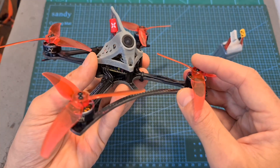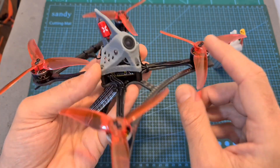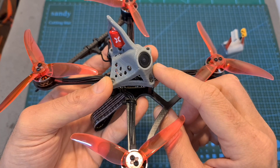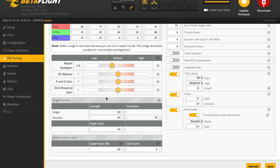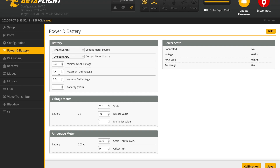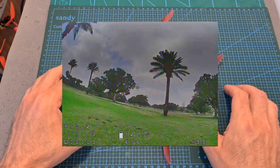You should note that if you are going to use a similar setup, you must limit the motor's output using Betaflight, as otherwise you risk burning the motors and damaging the flight controller, in case you are using one with an integrated 4-in-1 ESC that can handle a continuous current per motor of about 25A. Since the motor output limit value is different when using 3S and 4S batteries, you can define the scale factor and the number of cell count under different profiles using the CLI or the user interface in Betaflight 4.2. You also have to make sure under Power and Battery that the maximum voltage per cell is set to 4.4V, and then Betaflight will automatically select the PID profile based on the number of cells of the battery plugged in.